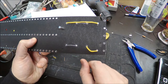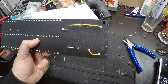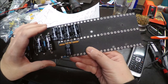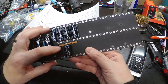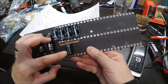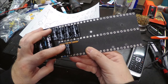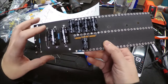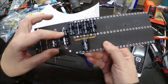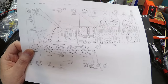We'll call this phase two. We've got our 40µF capacitors and 10k resistors, and then our 150µF capacitor for the bias — which is installed backwards, as these are in series. The plus and minus are flipped; make sure you double-check that on your diagram.